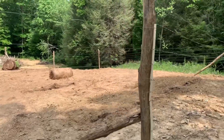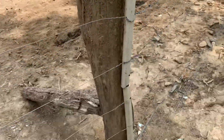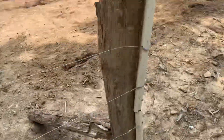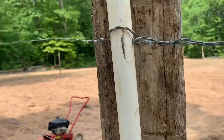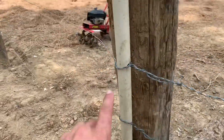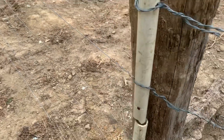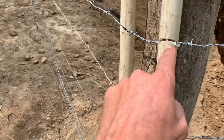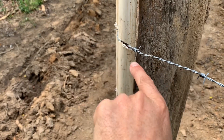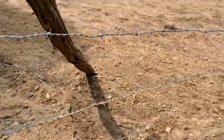So if you're working on a budget, here's an easy hack. This was some old pipe that I found and it works really well as an insulator — you don't have to purchase insulators. Just make sure it's not grounding out on that wooden post, which is really only a problem when it's wet. You can do it two different ways: you can drill holes through it and wrap the wire around it, or you can cut these nifty little notches at about a 45-degree angle so that the wire sits down in it and can't fall out if it gets bumped.